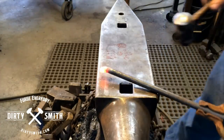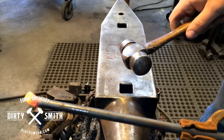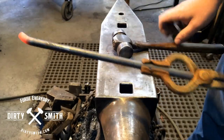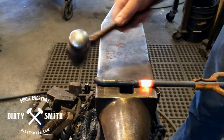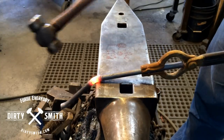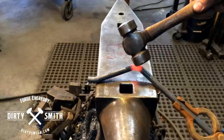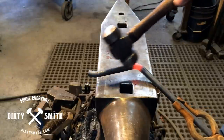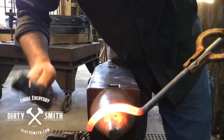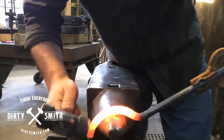Just knocking it over, just bending it. The next bend we want to do is back here and we'll do that at the vise. If you don't have a vise, use controlled heat. We want this to come around to our shoulder — again, bending. I always go a little bit further than what I think I need. So there's the bottom of our eye. Next, we'll heat this part up and bring it around. I'm just bending it — if I was forging it I'd be squishing and squeezing it, but I'm just bending it.